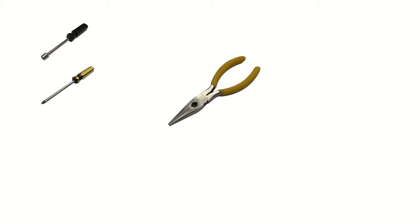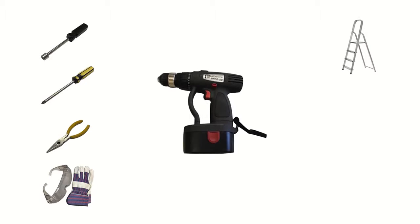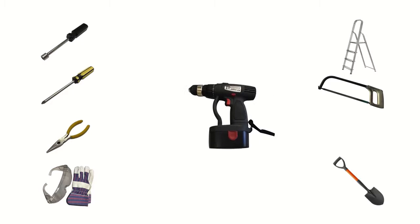You'll require the following tools: a 10mm nut spinner or spanner, crosshead screwdriver. Long nose pliers are useful to assist the beading process. Safety goggles and gloves are recommended for protection. Step ladders — you must be experienced in working at height. If installing onto hard standing, a masonry drill and hacksaw. A shovel if installing onto soft ground. This greenhouse has PVC bar capping secured with several hundred screws, so I would advise the use of a battery operated screwdriver.